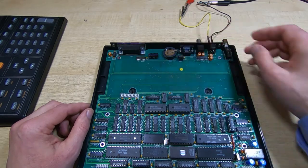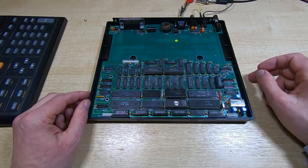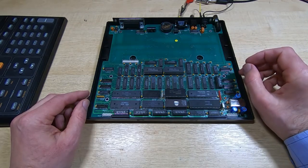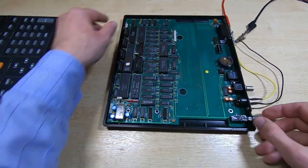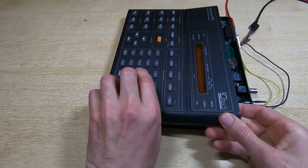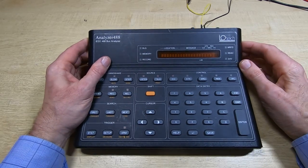I also replaced the DRAM at the front - I put a scope on it and it was not returning any data, so I replaced that device. Ultimately I replaced the other two as well because one of the pair was not really working very well. I don't think it was directly part of the fault, but I replaced them anyway. I'll now refit the device that was in here, reassemble the unit, and I'll show you what effect replacing the battery had.